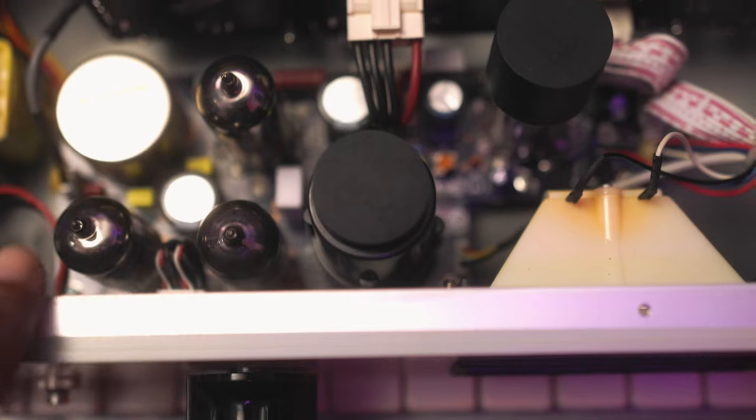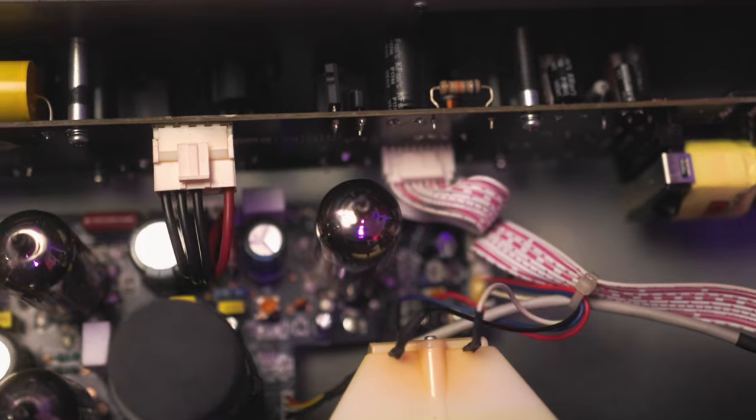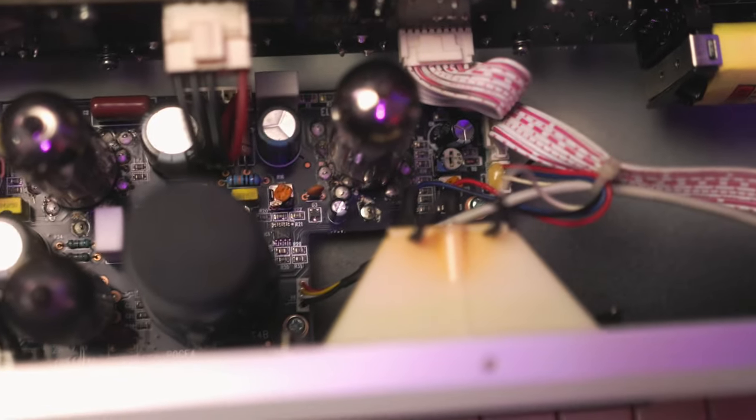Based on the schematics, there are two tubes in the audio path. I'm going to plug it up and see which tube does not get hot — then I'll know which one's the bad tube. There are four tubes total: one, two, three, and a fourth right here. Two of them are in the audio path, and one of those two is not working — that's why the needle is not doing any gain reduction.